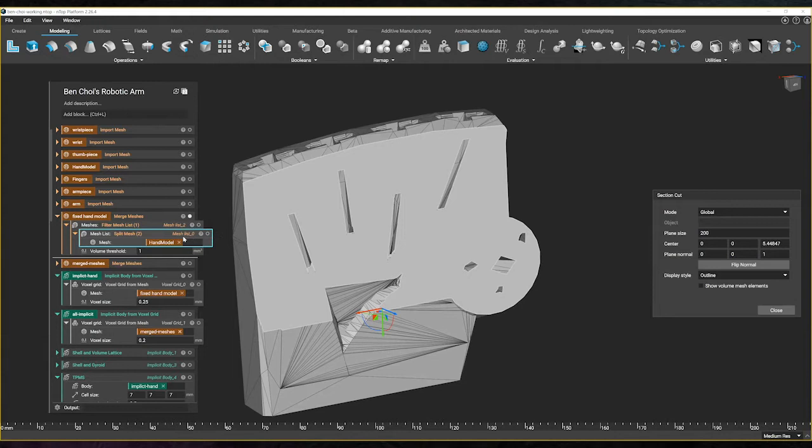So what I've done is I basically split Ben's original mesh into two, and then I basically filter away some erroneous, really tiny mesh. I'm filtering away anything that's smaller than a millimeter cubed, which is pretty tiny, so 1 by 1 by 1 millimeter. So there's obviously some little dangling triangle somewhere that we're deleting, and we're cleaning that up, and that's going to help us move quicker through nTop without any errors.